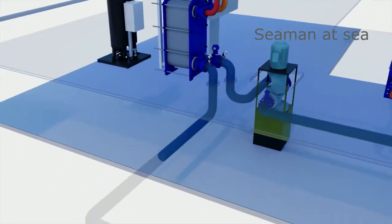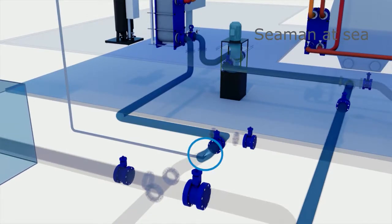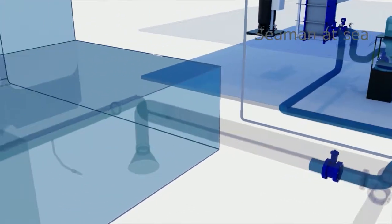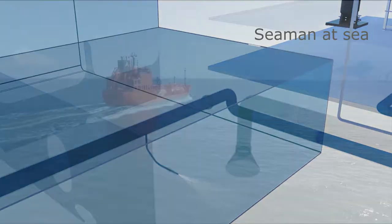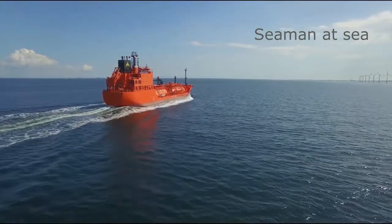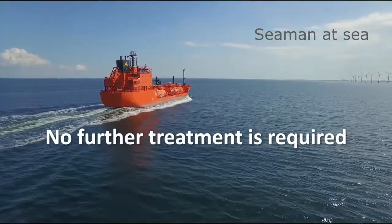In the circulation process, a small amount of nitrogen gas is injected into the water flow and deoxygenates the water. The deoxygenation eradicates zooplankton and reduces tank corrosion. The water is returned to the bottom of the same ballast tank through a series of injection nozzles, completing the circulation process. Circulation is performed as many times as necessary, and no further treatment is required before de-ballasting.